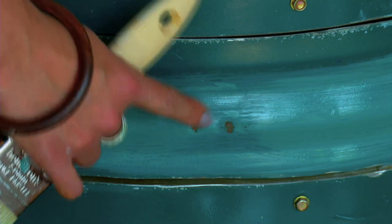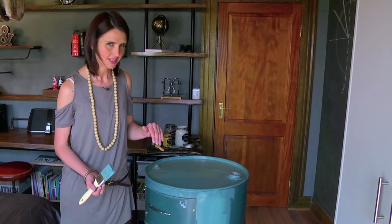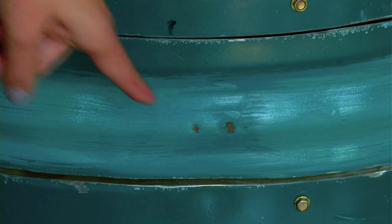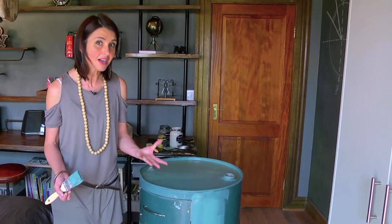As you can see there is rust over there. I will simply paint on top of the rust. If you are concerned and don't want the rust to grow any further, you can apply a rust converter first to stop the oxidation process. I will simply paint — in time the rust might reappear, but I'm not going to worry about it, seeing that this is an industrial style space.